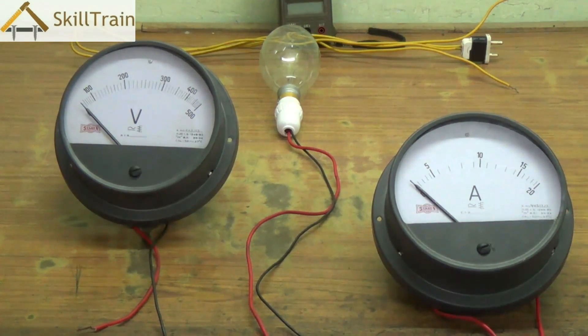You must always remember that the amperemeter is always placed in a series connection, and it's either placed in the neutral side or in the phase side. You can decide where you want to place it. It should always be in a series connection and only in either the neutral side or the phase side. You should not connect both neutral and phase to an amperemeter.